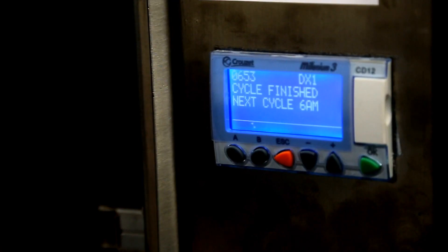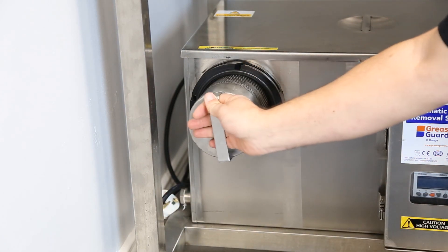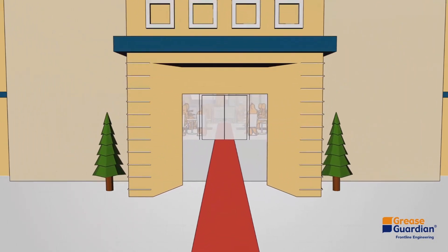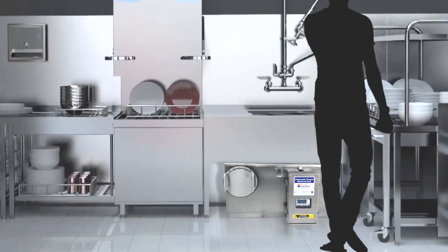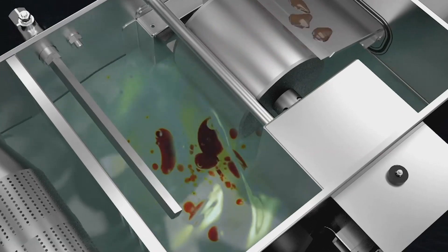When the cycle ends the display will indicate 'cycle finished'. Following this the unit will display a message indicating that daily maintenance has to be done — this will last for about 10 minutes. You can carry out the maintenance any time as long as the unit is not in cycle. We recommend maintenance is done first thing in the morning or a couple of hours after the sinks have emptied. Each kitchen is different — some are open 24/7, others only a few days a week. There are different ways to change how much you skim: you can add up the 4 skimming periods, change the intensity of each skimming period, or turn the program off on days when there is no grease being produced.